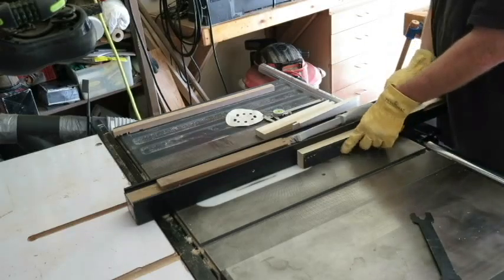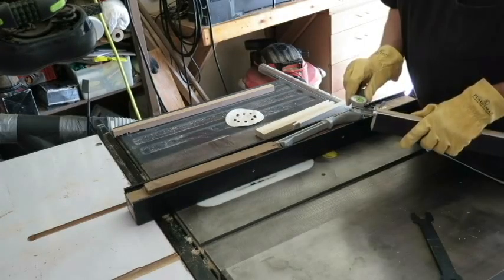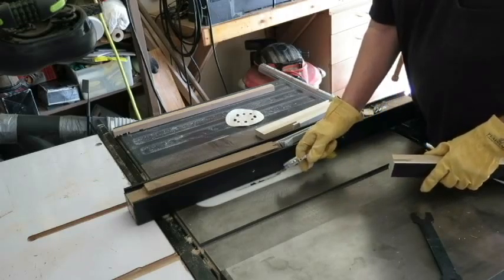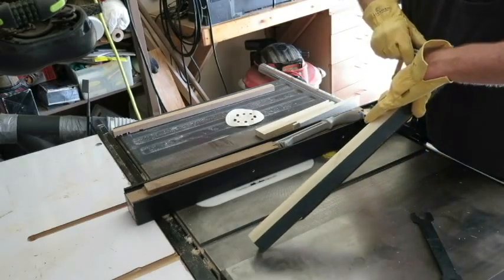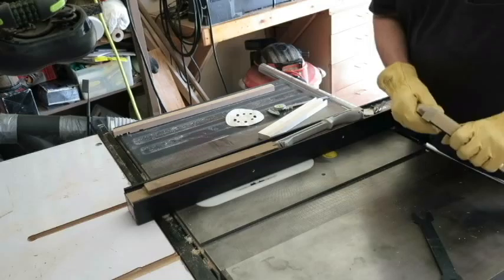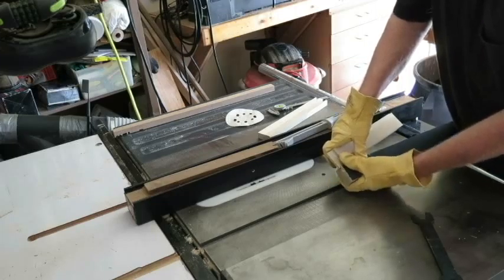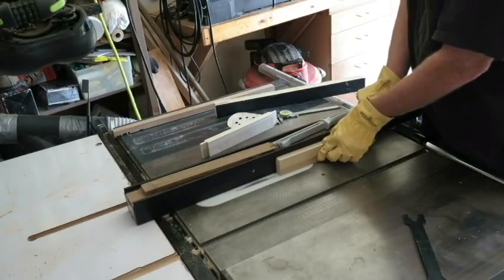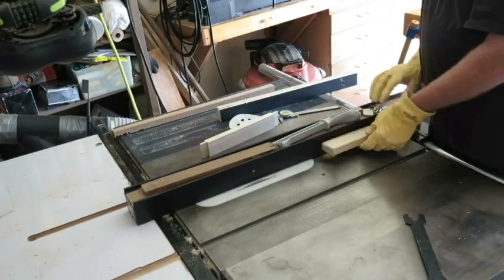I know it's too high at this point so I'm just going to drop it down and creep up on it. I am about a sixty-fourth over a quarter of an inch on the thickness from the front fence to the blade, and the groove is a little less than a quarter. So I guess my dado set's off. Let's see how these fit. Okay, that'll fit fine. And if I put the pieces together, that's fairly flush — that seems like a pretty good fit.